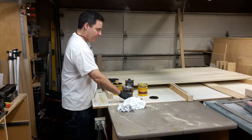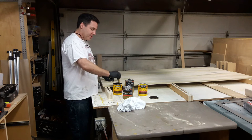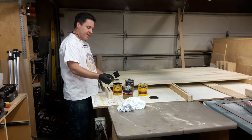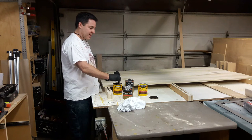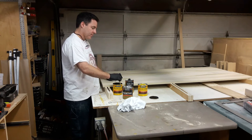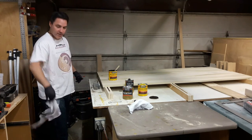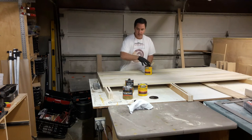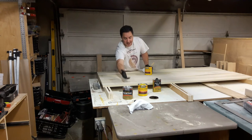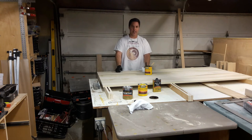First thing I'm going to do is make sure there's no pigment settled on the bottom of the can. I use whatever clean stirring sticks I have — paint sticks cut in half work great for pint or quart size containers. I also tack it off before the camera so I can go quickly, and you'll want to have a rag with you to get the dust off. From personal experience, you're going to want to start with the far end — if you start at the close end of something this big, you'll be leaning into it and ruining your shirt.